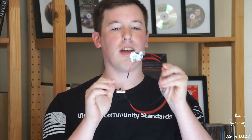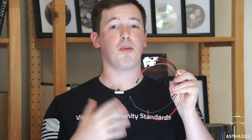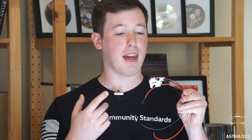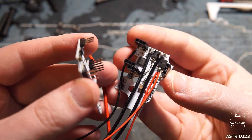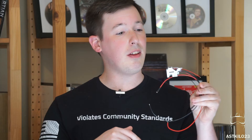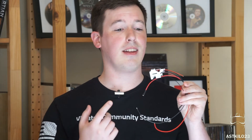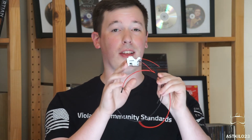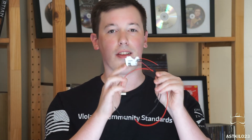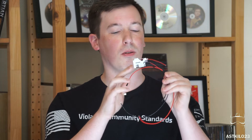The version 2.0 MOSFET has a lot of the major features that people want nowadays: active braking which is completely tunable, burst mode between three and six rounds, modes for AUG, snipers, shot delays, pre-cocking, and all kinds of things like that — and the ever-popular binary trigger. What I love about this MOSFET is that it is completely digital. No microswitches, no mechanical moving components. It's all based on infrared sensors, so no moving mechanical parts that can break.